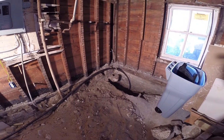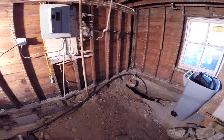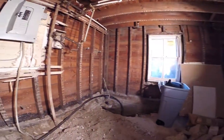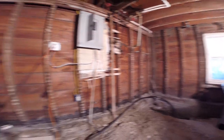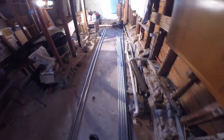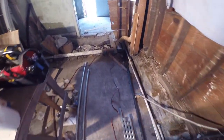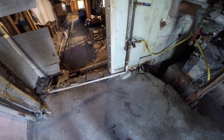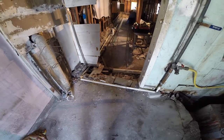We're gonna bring this water main up in the corner, tie it along the ceiling where it belongs. While CB is setting up, we're gonna bring this water main that runs along the floor back here, temporary water main, I don't know what happened here, first day on the job. We're gonna run a little PEX, which I really don't do, but we're gonna do it today, and retie into this copper water main. That's our first task.